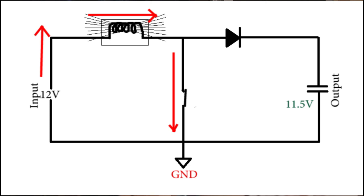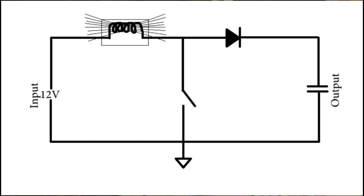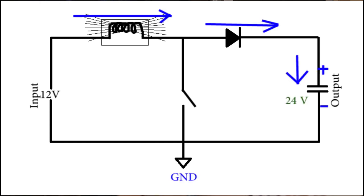We will just close the switch only for a fraction of a second — just enough for some current to flow to the inductor. When you do this, we are basically storing some energy in the form of a magnetic field in the inductor. Now that we have some current flowing through the inductor and some energy stored, we will quickly open the switch. As current through the inductor cannot instantly change, the current has to flow through the diode and into the output capacitor, the stored energy gets transferred from the inductor to the output capacitor, and the voltage increases. That's how a typical boost converter works.